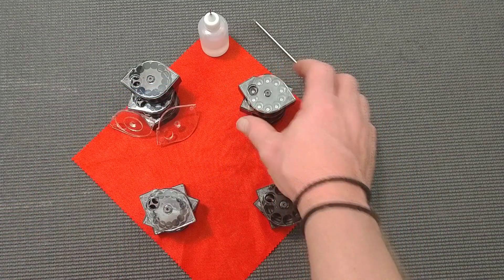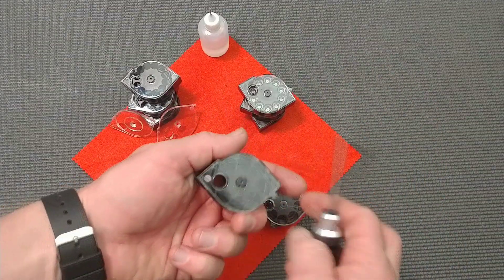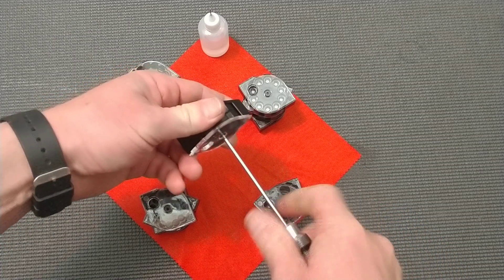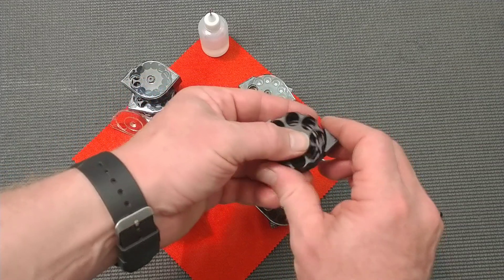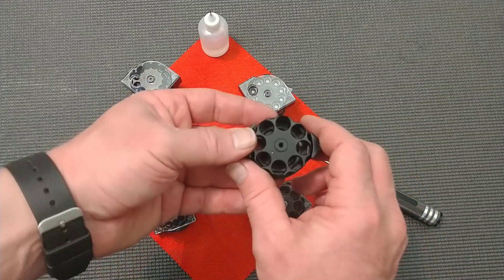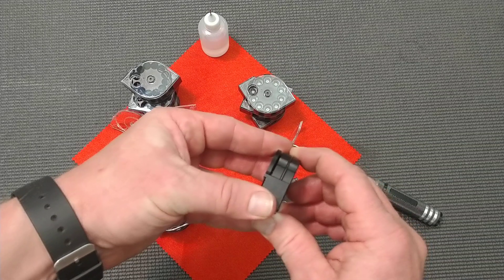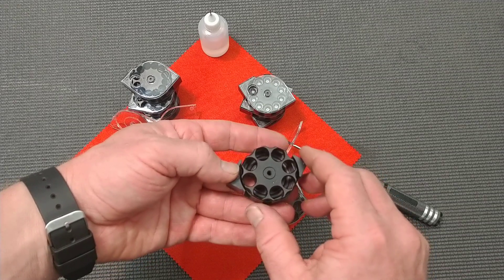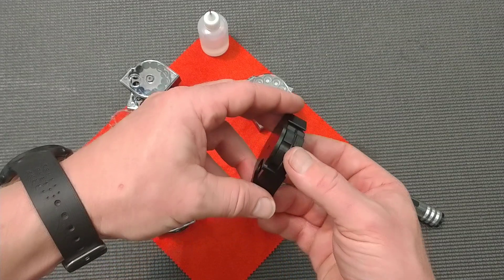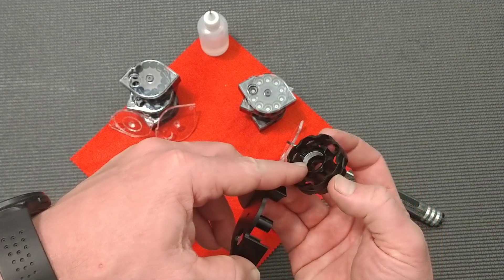Also, if your spring were to come undone or you disassembled it and you're not certain how to reassemble it, I want to demonstrate that. A two millimeter drive will remove the screw in the lid. There's preload built into the system with little internal machined features that act as an internal stop. Take the tension off that stop, lift it a little bit, and let it rotate past to take that preload out. Now it should be neutral because I only jumped the stop once, and now I can lightly take that apart — it's nice that the spring remains inside the wheel, which makes it easier for reassembly.